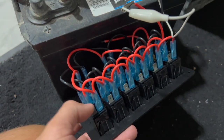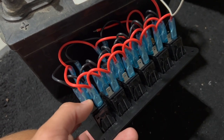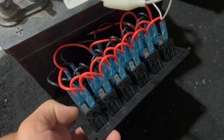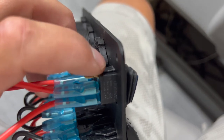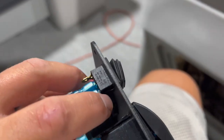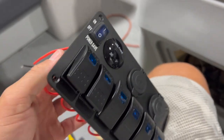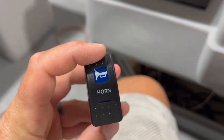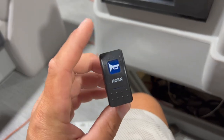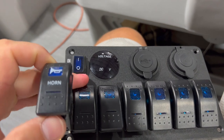All of these posts here — that's what our accessories are going to run off of. We're going to put a fuse in line on those, a little 10-amp fuse for each of these, so it's something that can be replaced or repaired if a fuse ever pops. It's just a couple of detents on each side that you pinch and they pop right out. The other thing I need to do is get rid of this first switch and replace it with a rocker horn switch, also from Amazon — a few bucks — and it's already labeled.